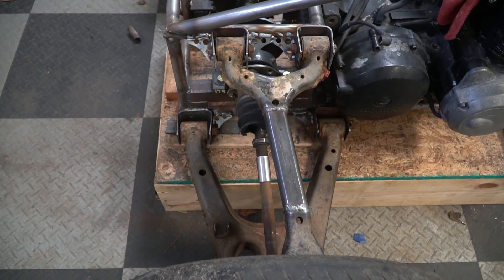One of our concerns has been wheelbase. If the wheelbase on this thing is too long, then we're gonna need a really tall ride height or else we're gonna bottom out on everything. I think we did a decent job in tucking in the rear suspension as far forward as we could have safely. Now we just need to do the same for the front.